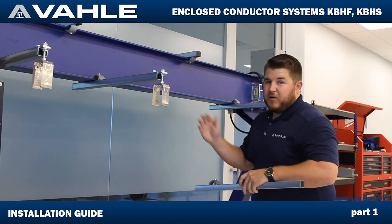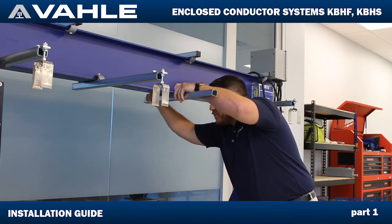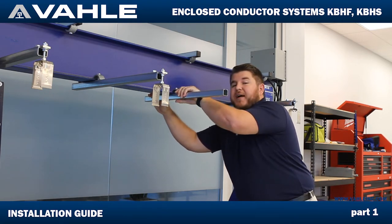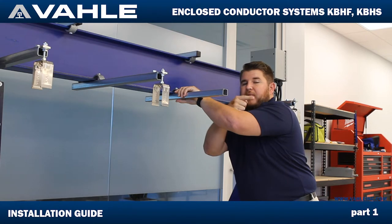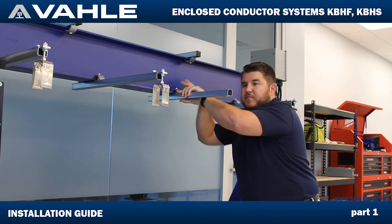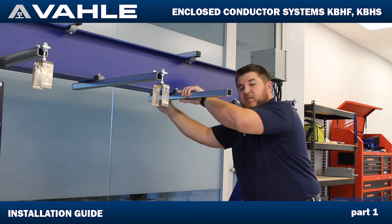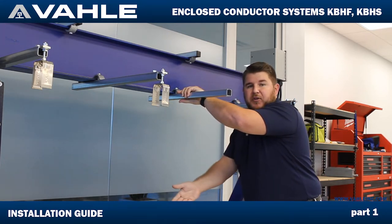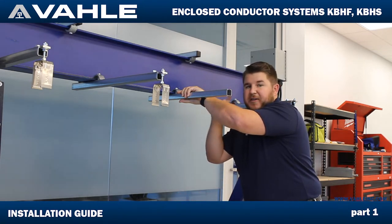I've also marked on the beam where I would like for it to go — a good practice to have. If you're going to pull the railing this way, you want to hold this side. If you're going to push it back the other way, you're going to want to hold that clamp on that side, so that way it doesn't fall off and drop twenty or thirty feet or maybe hurt somebody below you. Make sure it doesn't fall off.